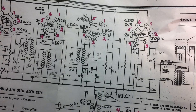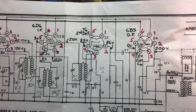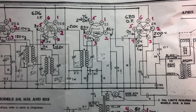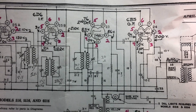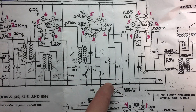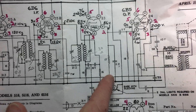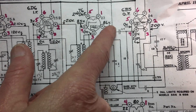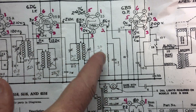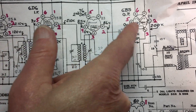When I first got into this, I went in with the assumption — and you know what assuming does — that all these capacitors had the common lead on the strap, which in this case was to chassis ground. This dark line here is chassis ground. Here's 11Z. If you go in with that assumption, you think that is the ground strap. But when you look at 11Y, there's no way 11Y and 11Z have a common at ground, because one is a coupling cap and one is a bypass.